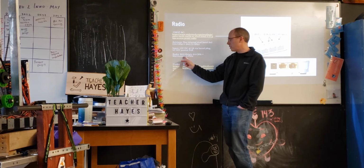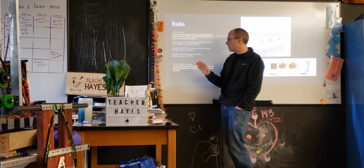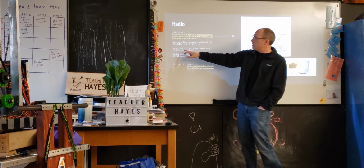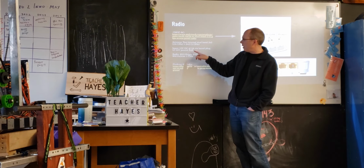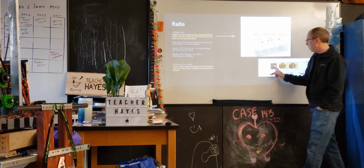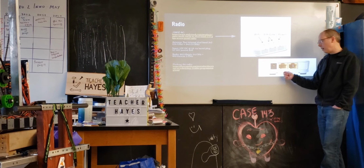this thing. This supports several. They specify certain ones. That's part of the reason why they use the firmware, is to make sure everything is locked in together. You can see this is a 12 volt. That's easy. It can be powered either through a voltage here or through the actual Ethernet connections. Typically, Ethernet is not powered. You will typically see PoE specifically, which means power over Ethernet. A power over Ethernet connector uses the same connector, but some of these pins are live with voltage signals that allow you to power things.